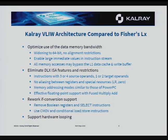In fact, the principle and the foundation for this VLIW come from the LX architecture defined by Josh Fisher, Faraboschi, Homewood, and Desoli in the ISCA 2000 paper. And this LX VLIW was, in fact, like four DLX pipelines put in a VLIW form. It was a very elegant, very simple VLIW. I worked on the compiler and on the architecture evolution of the product version of LX, which was the ST200 VLIW manufactured by STMicroelectronics.